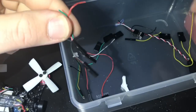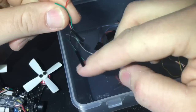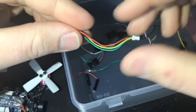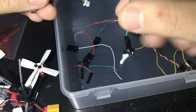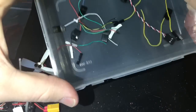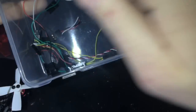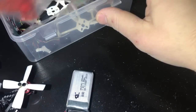The single connector wires came on the SBUS cable, which goes out the front of the FC. That's for SBUS — those connectors were plugged in at the front out of the box. The PPM connector has all the individual wires for PWM if you want one wire per channel. I cut them all off and soldered directly to minimize everything. That covers all the wiring that comes with the quad.